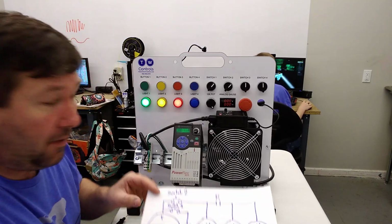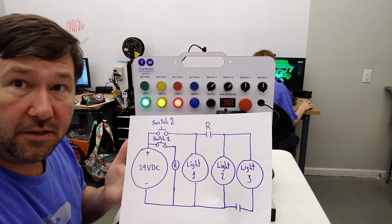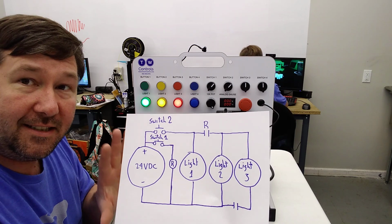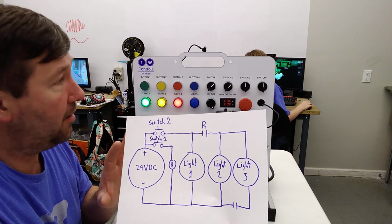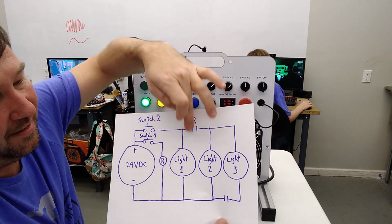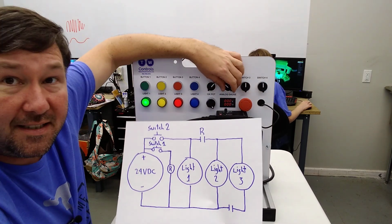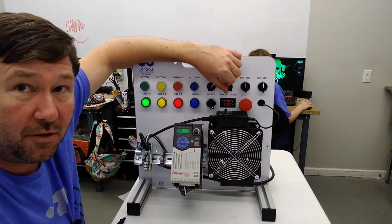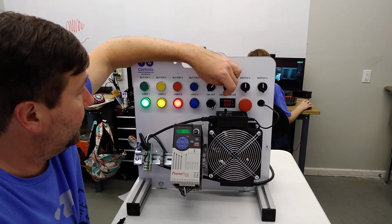And finally, we have this diagram, which if you're an overachiever, you can take a screen capture of the video right now or pause and wire it. But mainly, I did this one because I wanted to be able to switch between the series and parallel wiring. And so I added a switch to a relay that would actually switch between these lights being paralleled and being series. That way you could see the difference. And mainly in the next video, we're going to talk about the actual voltages on them. And I didn't want to have to keep wiring and unwiring, so I did this.